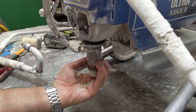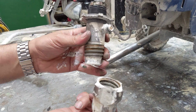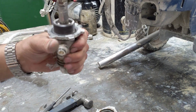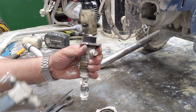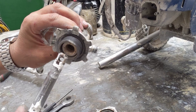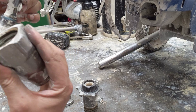This has still got some wet paint in there — after it broke down it was brought to us like this. Now I want to inspect the pump because basically this is everything I need to be looking at. I'll go back to my wrench, loosen up the top packing retainer, and then knock the piston out nice and gently. So there's the housing — my pump out, my valve housing and my piston housing. In there are the top packings. This is the piston rod, these are the lower piston valves, and the packings sit right here. And over here we have our inlet valve housing.